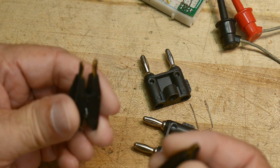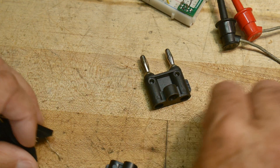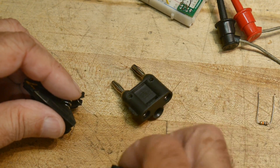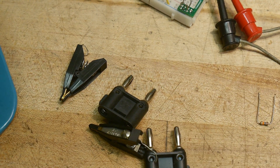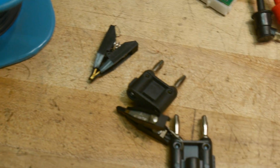So you have two wires back to your multimeter to do a four-wire measurement. I didn't know I had these! I'm going to make a cable — it'll have a source and sense, running over to source and sense on the two sides. I'll use some test wire that I've got.